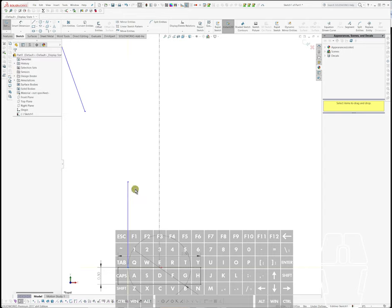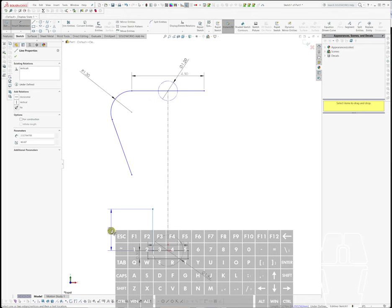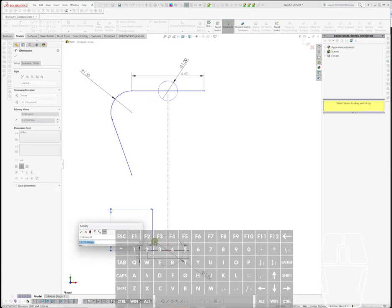And I also, I don't know if you saw the other video I did, of some hooks to hang the barbell from to store it, and a 45-pound barbell. For that I did some FEA just to get a basic idea. Even though it's a plastic, so it's not a linear stress-strain curve, I can't really do accurate failure prediction as far as at what weight it would fail. But what I could do is at least see where the highest stresses were and apply a very strong factor of safety to it, so I knew it was plenty overkill. And it works great, and it's been holding my barbell up on and off for, I don't know, months now. At least a month. Anyway, so let's see.